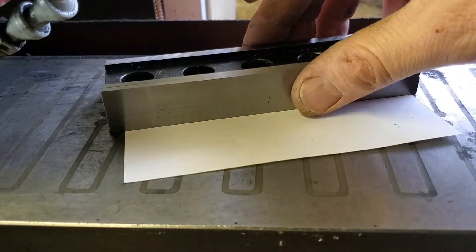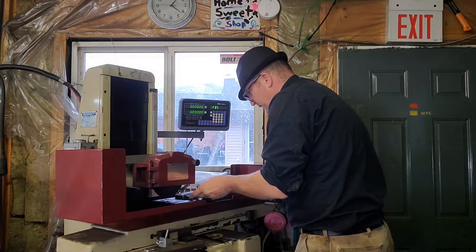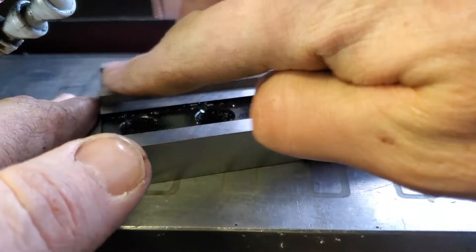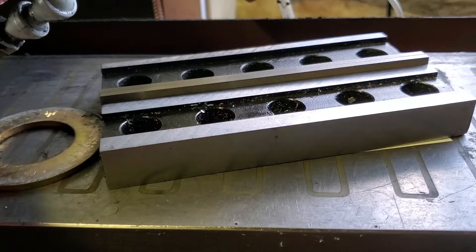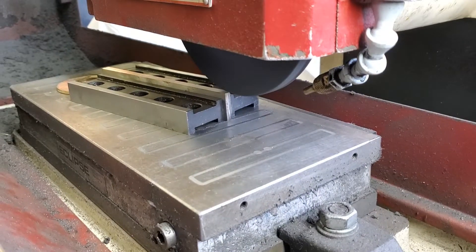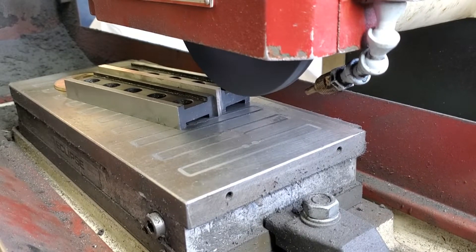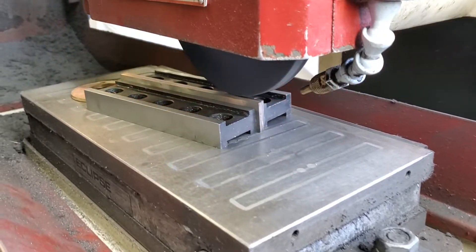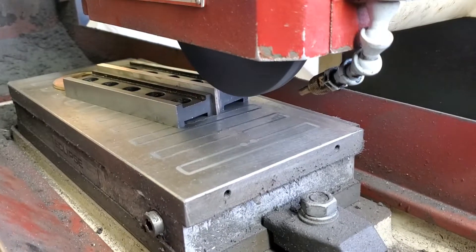I'm putting these two on end together as a matched pair. An astute viewer might have already noticed that I'm putting down something that's already ground — I did have a problem with my camera, so I had to go back and show the process of holding them down. The washer on the end I found was important so the two files didn't go shooting out. Just like the other process, I went back and forth and then flipped them upside down and took the paper out. There's one small difference: because I'm only ever using them on their edge, I had to be very careful not to heat them up.